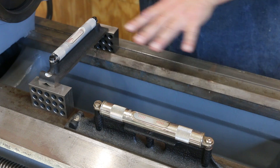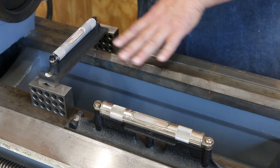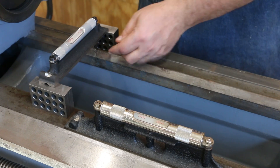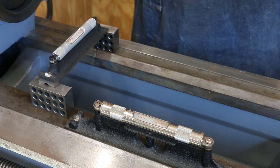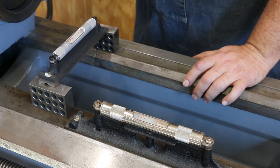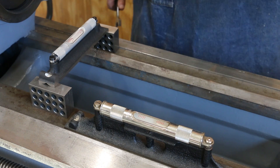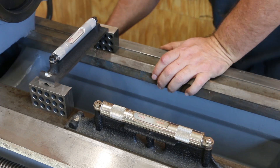On the one going across here, I've got a couple of blocks laying on two areas that should be in plane with one another, and I'm just bridging across that. Right now the backside needs to raise up, and on this one the tail end down here needs to drop down. I think I'm going to get it level across this way first — just a matter of preference. I'll do this at both ends and get it kind of leveled, and then we'll worry about going up and down. I'll have to go back and forth and check this because as we make adjustments, it'll change everything else. So let's just get it leveled up in this direction — I'm going to go down below and tighten up some screws and see if we can see that bubble move.